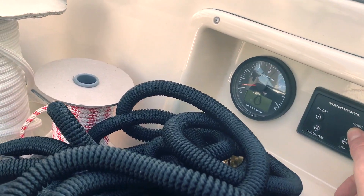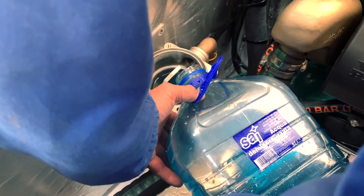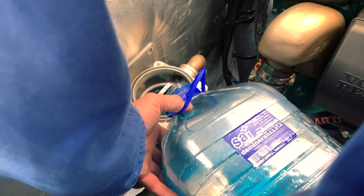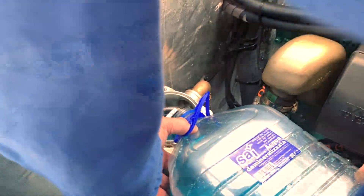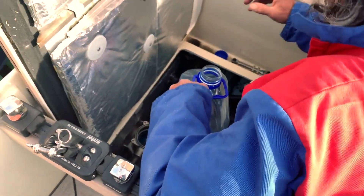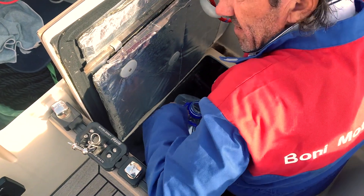They ask me to start the engine to allow all the liquid to go through the circuit. We don't need too much cooling liquid, but enough to fill up the entire system including the water lock. A visual check confirms the liquid has filled the entire circuit — and it has, because it comes out from the exhaust pipe. So we jump down and we know that all the antifreeze liquid is throughout the system.